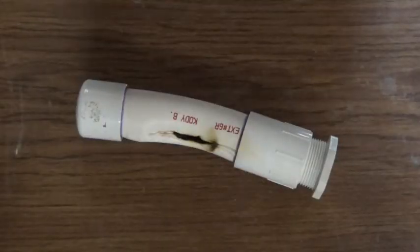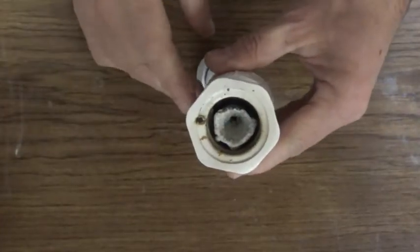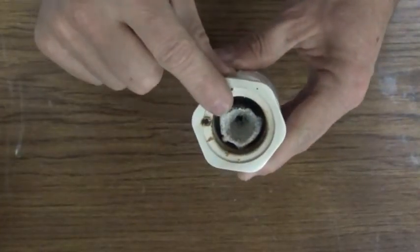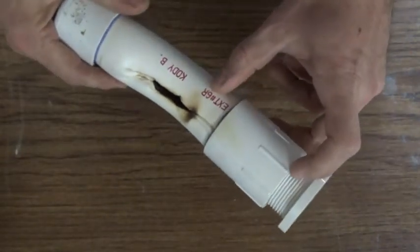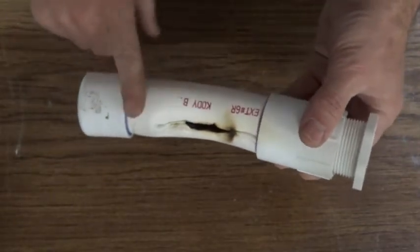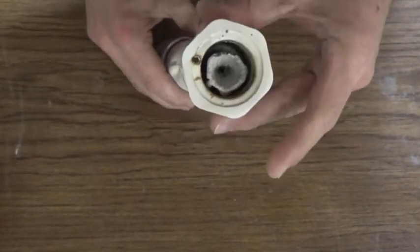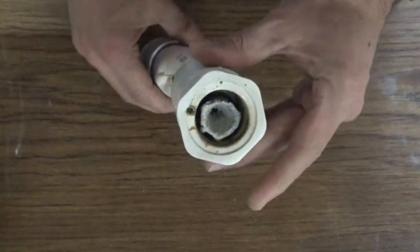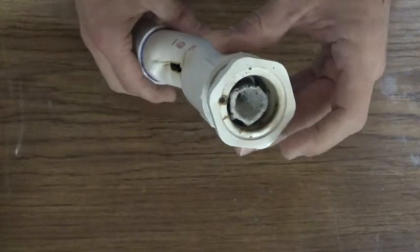So I think we learned a couple things about this. In order to get it to not explode, we had to use a number 15 nozzle, which is good for the Bates core section for about one and a half seconds. But when it converted to just being an end burner, that was a very large nozzle for that amount of fuel burning. So we got a long burn time but very, very little thrust.